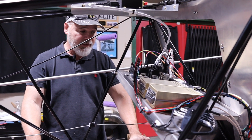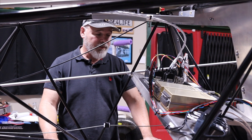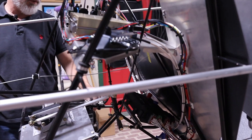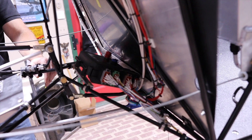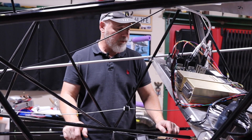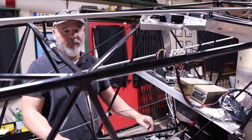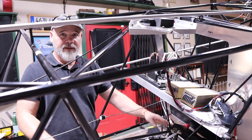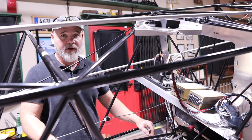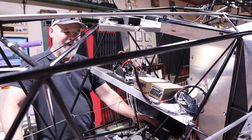For anybody that has concerns about going with the PDM — don't. It's really simple: you've got inputs and outputs, you can program them to do whatever you want. It gets rid of every solenoid and relay you could possibly have. They make it in multiple sizes — the 15 and the 25 are the two I know about. They are pretty pricey but extremely reliable and very lightweight. It also talks to my ECU via CAN, so for example if you have an electric water pump or electric radiator fan, your ECU can feed temperature data into the CAN bus of the PDM and you can tell it when you want your fans and water pumps to kick on. And if I want my lights to wig-wag, I can program that in — just about anything you can think of.